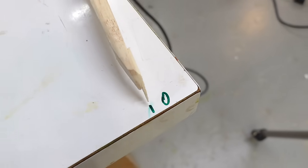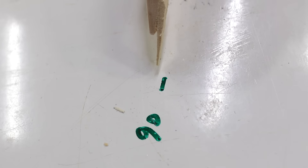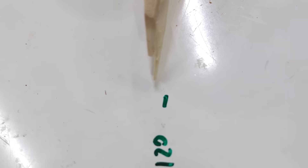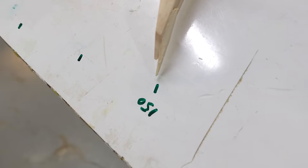I move my pointer 180 degrees with respect to the motor to see if it hits those marks again. At 30 degrees it's pretty good, at 60 we're off a little bit, at 90 we're off a bit more, and by 120 we're more than half a degree off. At 150 we're a bit closer again. So given the precision it can achieve on angles, the absolute accuracy is a little disappointing, but probably doesn't matter much because in real life a servo is almost always used with a gear reduction, at which point accuracy multiplies a lot — and if it's a belt reduction, the belt has far more inaccuracy than that.